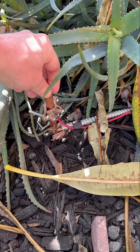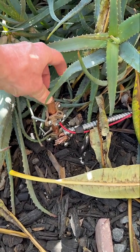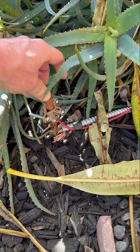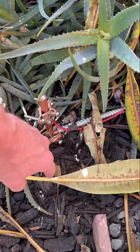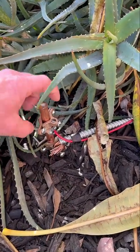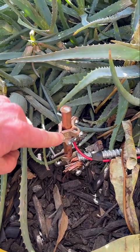This is your 8-foot grounding rod. You can get these at Home Depot — they're about 30 bucks, not very expensive. I have a YouTube short of me driving this down. It takes about 10 minutes after a rain and goes right into the ground — very easy, even in the hard California dirt. It connects right here on one of those clamps you can find on my link.